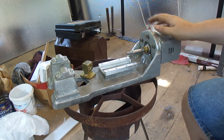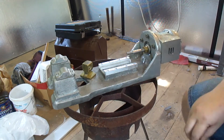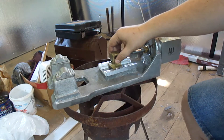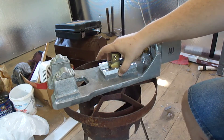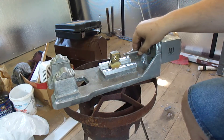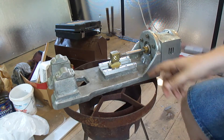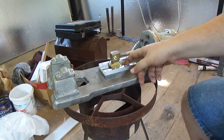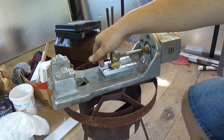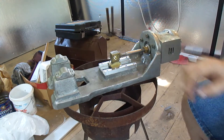Yeah, this is all done up. I've got a 3D model of these set up here. They're a little too high for the layout — a little too high for center height. I'll have to take and machine that down. I put it as 5/16ths of an inch, but I need to go quarter inch between this part here that the crosshead rides on to the base.